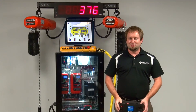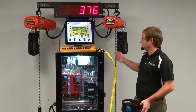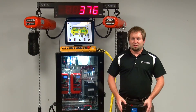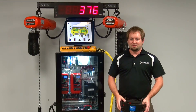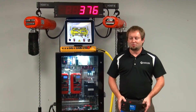The goal overall of this feature is for safety — to prevent the overloading of, say, a single hoist, or a bridge structure or a trolley structure with multiple hoists. When each individual hoist, or a sum total, prevents an overload that is configured within the drive, it'll prevent motion, which leads to increased safety to the structure or personnel.